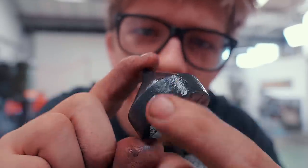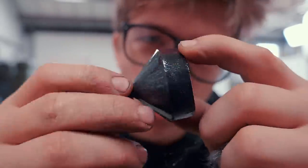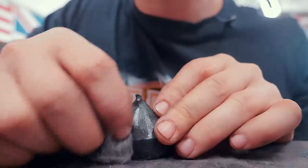So I just took this out of there and I rinsed it off in the water with gloves on. How cool does that look? It is all the way black. That looks so cool. I was really worried as to how this would look because at scale, obviously it's not going to react the same way a true metal will react with the cold blue, as cold blue is designed to work with true metal.